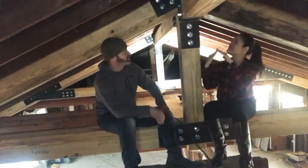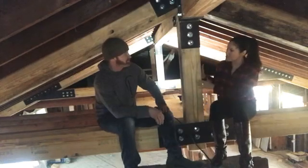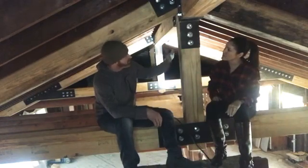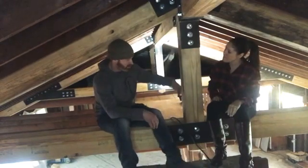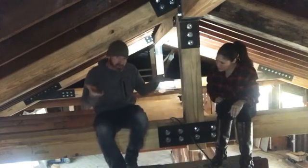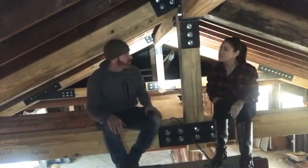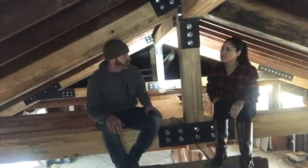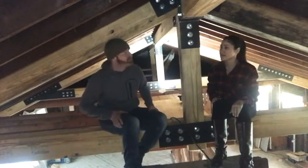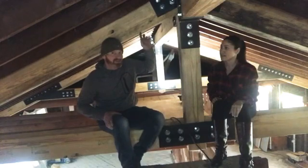Once those were up, the next piece you put up, was it the center or across the ridge? Once those two pieces are up, the center pole was hung down. And then the two horizontals were lifted into place on a lift that maxed out to capacity. Because of the weight. The lift actually lifted 400 pounds. Each one of these was close to 450.